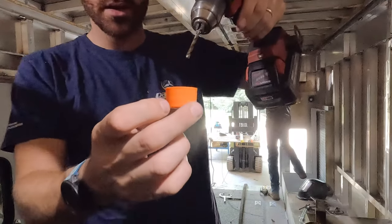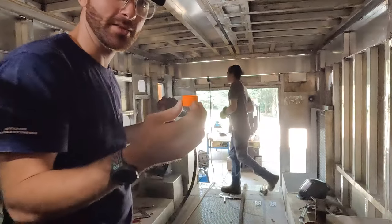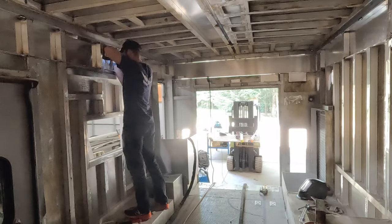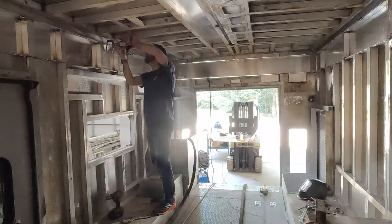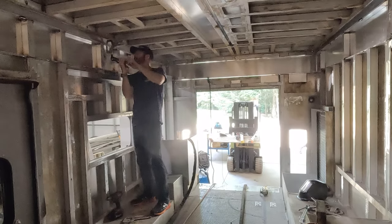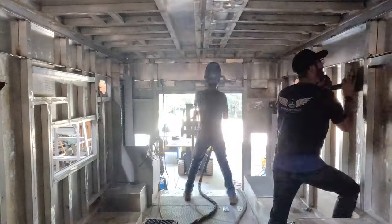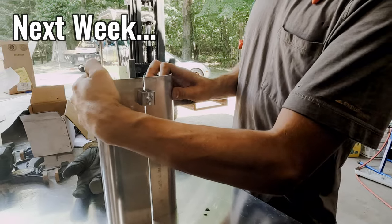Master Sawyer. Oh yeah. Man, I've been doing it a long time. Taught me to put oil in a cap as opposed to spray it on. Then I can dip my drill bit in. Then you don't make it giant. Makes it a lot cleaner than the big spray. And it holds a perfect, it's a little smaller than a 16th inch cap.